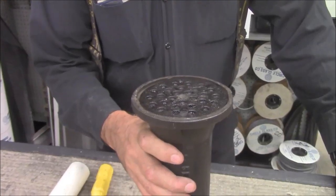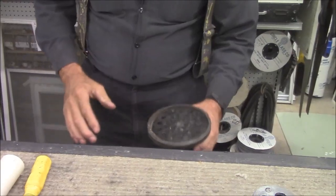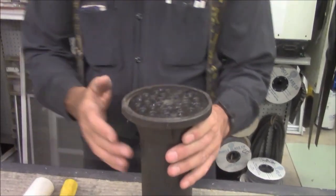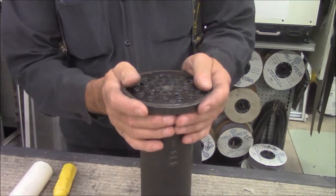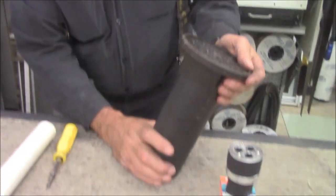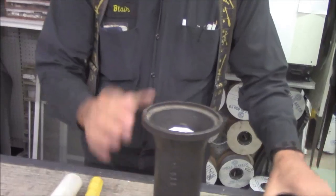Let me show you a floor drain. I have a demo here of a basement floor drain. This would be flush with the floor of your basement. If your home was built in the baby boomer age — as many in this neighborhood were, built from 1942 until 1965 — this is a standard 3-inch floor drain. This is 3-inch cast iron, 3½ on the OD, but it's 3 inches on the ID.